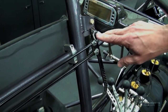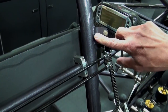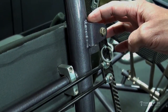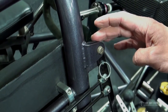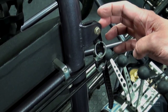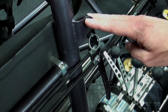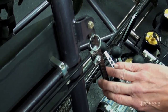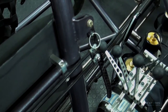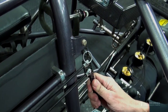That safety pin usually stays in between runs. These two tabs — you can see this one tab is bent, and the back tab is straight — it's mounted to the Funny Car cage tube. When we mock this up we take a small AN washer and put it between the handle and the tabs to provide a little space so when it's welded it isn't too tight. The handle has just a little bit of slack so it's easy to move and doesn't get tight on the bolt. This bolt has a nylock nut on it so it will move really easy.